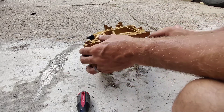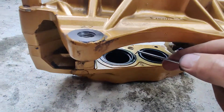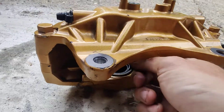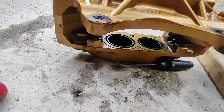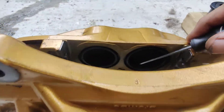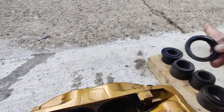I just have these little gasket pullers. There's actually a notch — if you look in there you can see these little notches, a little hole. You get your tool in there and pull your seal out. That's the seal, and then there's another seal about a quarter inch or so down. This is the money seal — that's the fluid pressure seal. The outer one is more of a dust shield to keep dirt out of the bore.